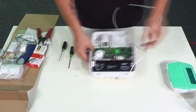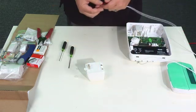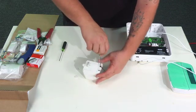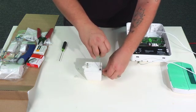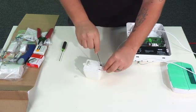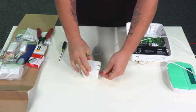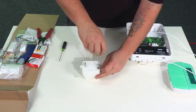On the other side of our wire we're going to get our transformer wired up. It's going to be one wire to each terminal again — make sure you don't have any excess copper wire touching each other. Tighten those down and always check your connections because you don't want any loose ones.